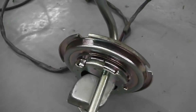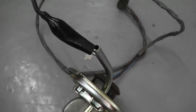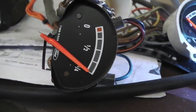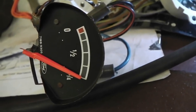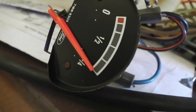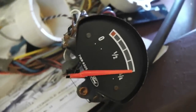Okay, the fuel gauge is connected into the loom and power is on into the loom. We've earthed it just there for now. Up we go, slowly take you up and onto the bench. So we've got the float on full tank and across to the gauge. We're looking for full tank, and you can see there's 2 little calibration dots. Can you see those? 4 altogether, 2 for 0 and 2 more for a full tank. It's just between the calibration dots, just, on the gauge itself.